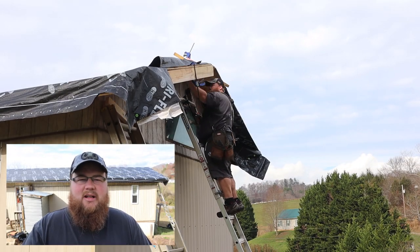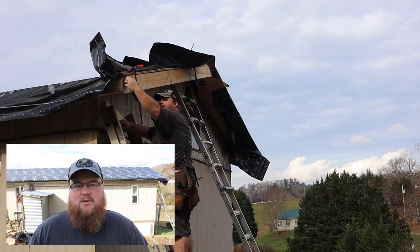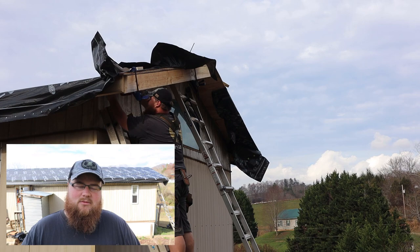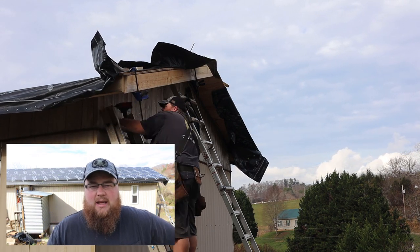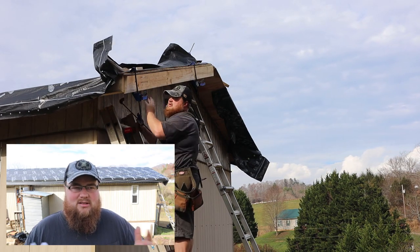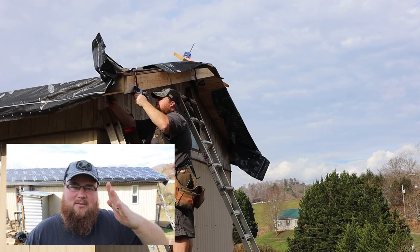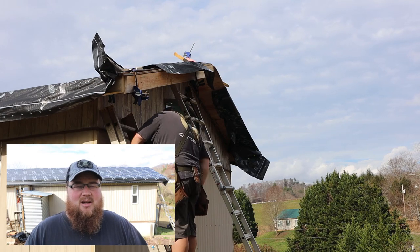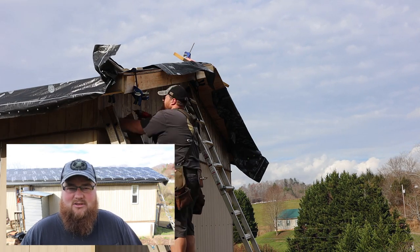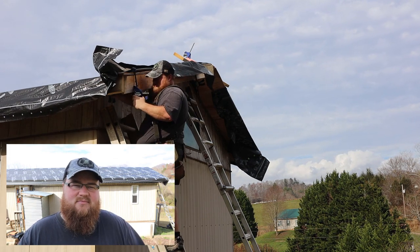Another question: in my earlier tools video I showed plywood clips that I planned to put between all the sheets of plywood as we decked the roof, but then they were never seen being used. We started using them but found that once the clips were in place, there was still flex to the roof — that's just how it is with a mobile home. Over time those clips would bend and poke up, which I knew would tear the synthetic underlayment and create dimples in the new metal roof going over top. So we didn't use them, and instead just spaced the plywood sheets about an eighth of an inch apart for expansion and contraction.